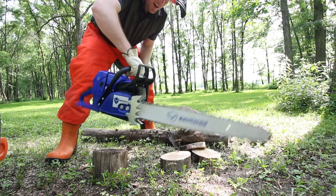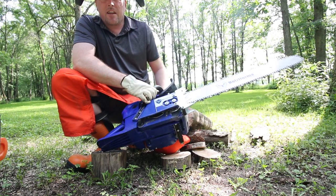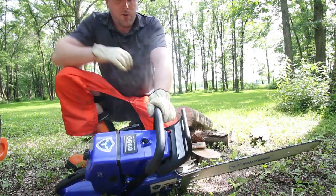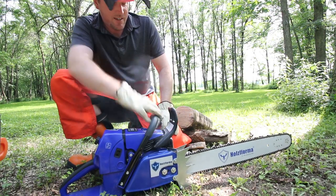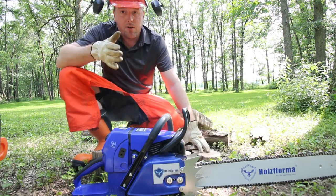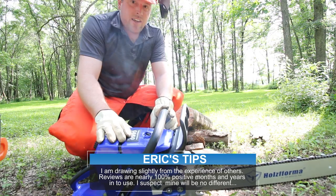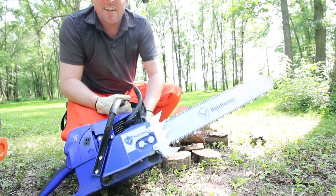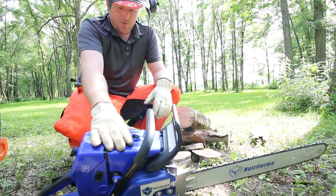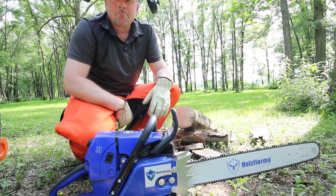This is not your average firewood saw — there's no need for anything this big for just firewood, but when you get into the big stuff, this thing is going to get you there for a really reasonable price. Unbelievable. So far so good, but only time will tell. I got a little bit of oil on the exhaust when transporting it. I'm happy — I highly recommend this so far, but again it's early. I'll do a follow-up in a few months when we've got more run time on it. I mixed it 40 to 1 just for the first tank, so the oil on the exhaust isn't coming from the engine — that's normal. I think this thing is a winner. Let's put it into service and see how it does.